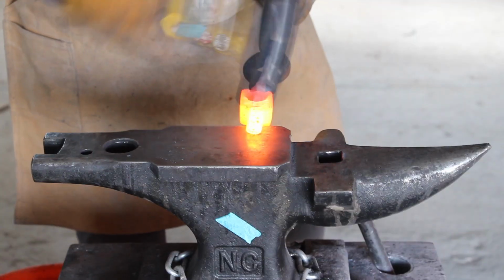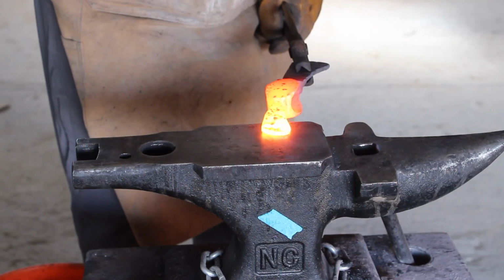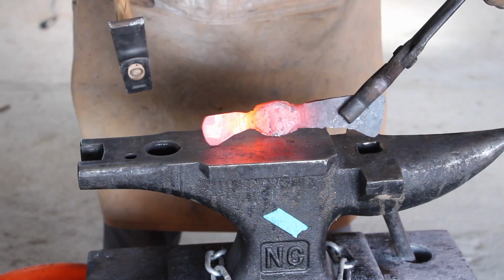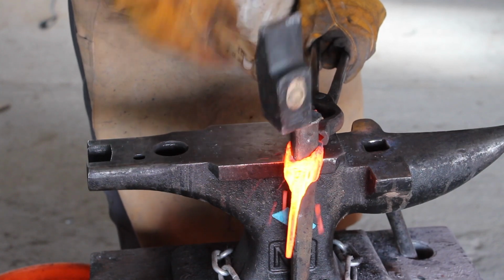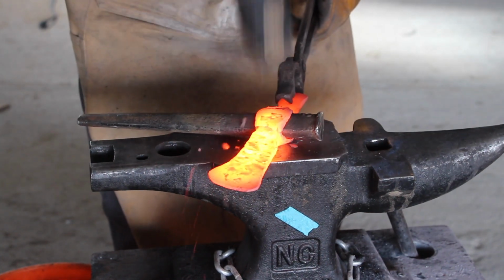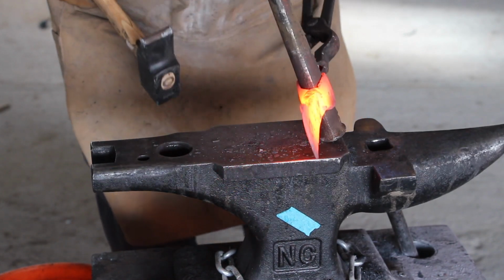In order to make this secondary peen axe head, I have to do the arduous task of repeating everything I've already done on a smaller scale. However, it's at this moment that I notice that neither of my blades are centered and the eye looks terrible. I use a lighter hammer to re-drift and do everything I can to get our blades centered again.